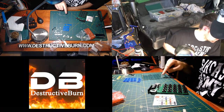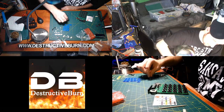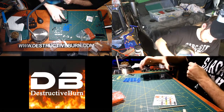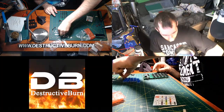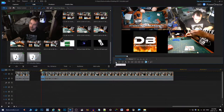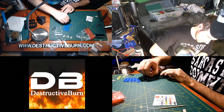The smaller screws are for the acrylic mounting and the longer screws are for something else. Put the small screws through and add the transparent spacers, then the board sits on top. Just don't over-tighten — you don't want to break the acrylic or stress the board. As my future-editor self recommends: definitely take the PCB out of the acrylic case first, put the transparent pieces onto the buttons, then put the PCB back into the case. I flexed it a little doing it in place but it seemed okay.